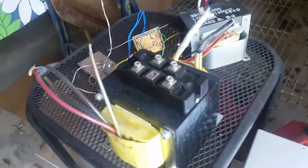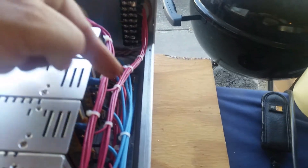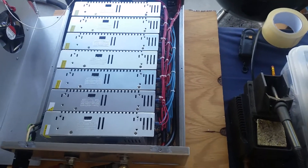It is a lot more labor to build these than to take an old toroid — there's a 250-amp toroid right there — and build a power supply with iron core, but you've got your pros and cons. I decided to bus the AC hot and neutral individually, which was a bit time-consuming. A lot of people just snake the AC — bring one wire in and jump units — and that definitely works, but I'd rather do it the best way possible and let each module have its own power wire so I know it's getting all the amperage it needs.